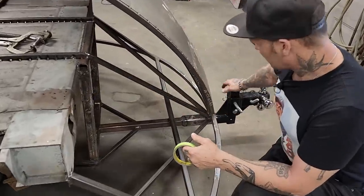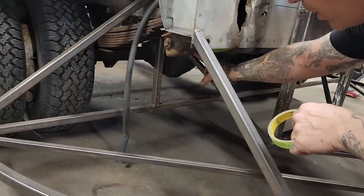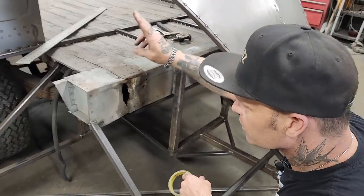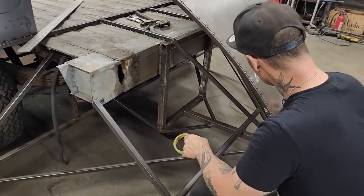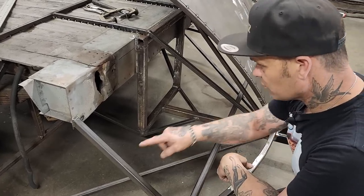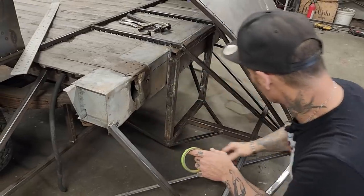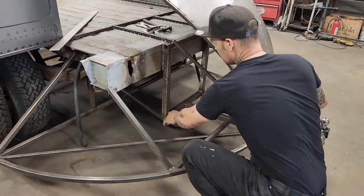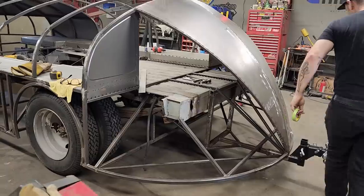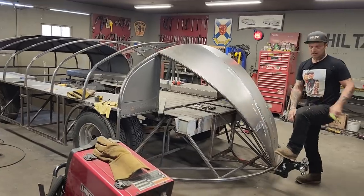Where I've got this here now, and I'm thinking that's probably good enough, I just went one step further. I welded a piece of square stock from here up to the piece that's welded onto the frame, so you'd have to shove this piece of square stock through the frame of the truck, up through the floor to bend that down. So when the pressure comes down on that, if this bar is not taking it, and you've bent that, and you've bent that, and you've bent them all over there, you still have this one here that goes from the back side of this up to the frame. So you have to think about it. You'd have to pull this off, bend that up through the frame, and bend all this to move that. So I'm pretty sure, like I'm about 99% sure that we're all good to tow anything that we want on that.